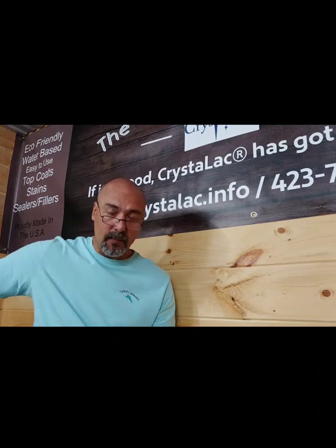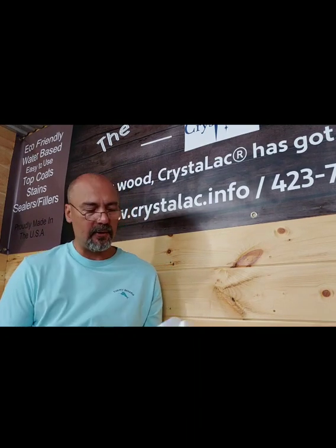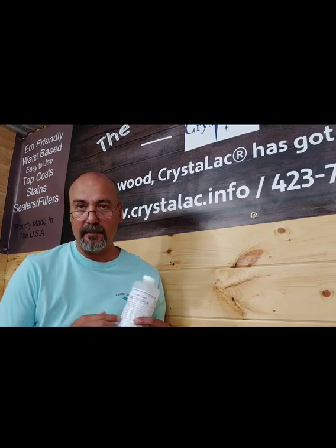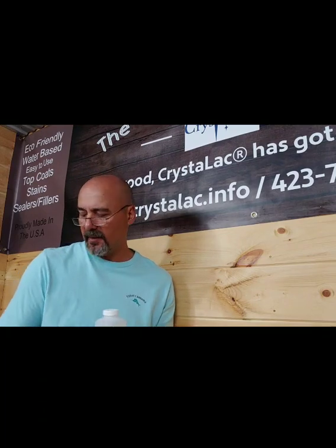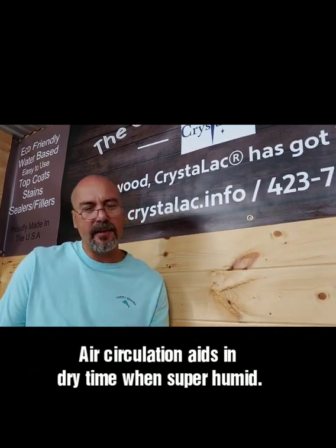One thing that can help with dry times and with dealing with that humidity is to find a good retarder. Here at the CrystaLac Company, we make a retarder that can go into your finishing products that slows it down just a little bit and allows it to work and self-level and not ghost up and get that cloudiness in it. So that's a couple real quick tips on what is a dry time.